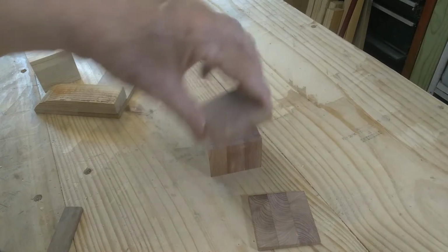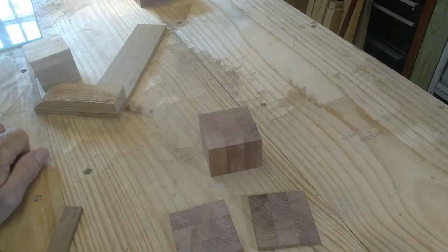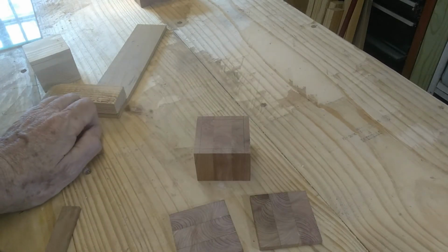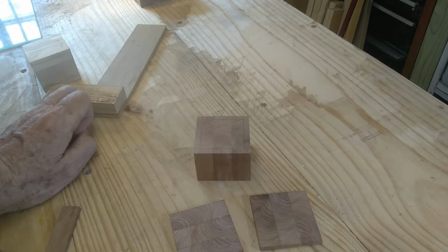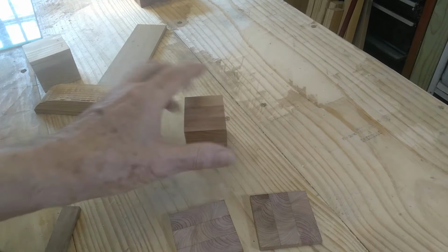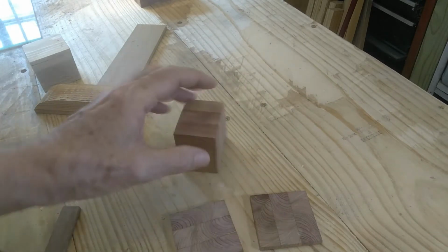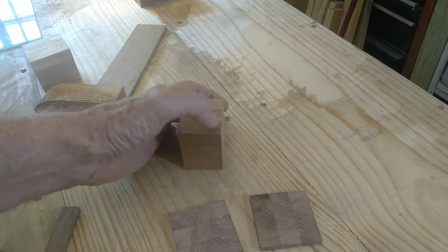I'm going to try to mash it back up where it comes from, but what I've done now is I took this over because I used a smaller blade than I usually like to use, but that's what I had in non-reverse tooth. Larger blade, less likely to wander down through the material. And in both cases, it was off just a little bit, a couple of 32nds